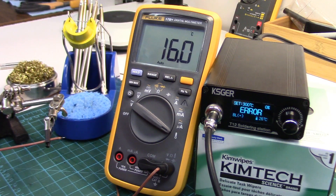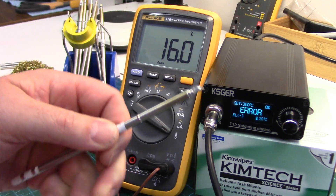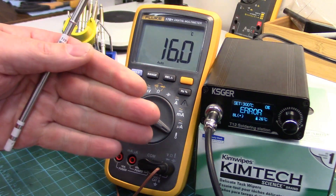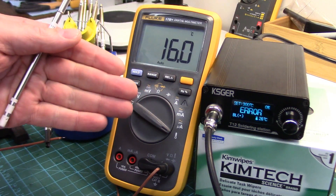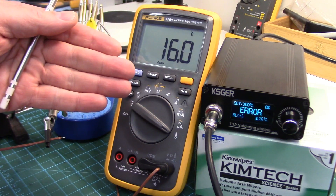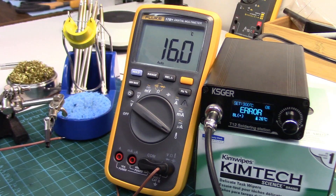It's quite dynamic in that you're not just calibrating it for a single set temperature — it's actually done in phases. It does three phases of calibration, basically from high temperature to low: a 450°C calibration, a 350, and a 250. We'll just take it in that order.